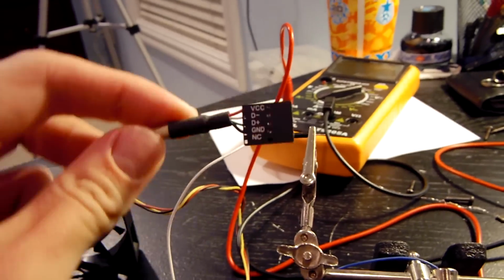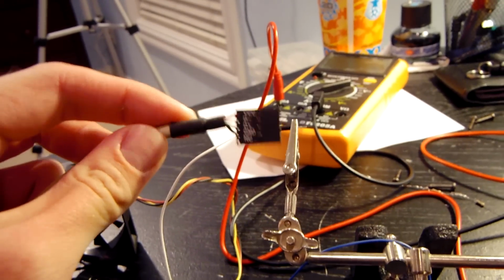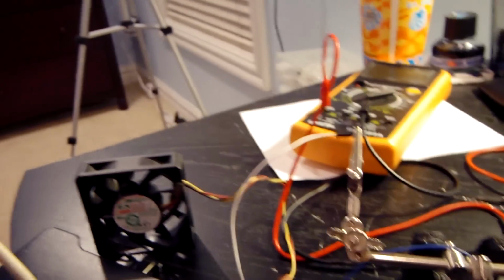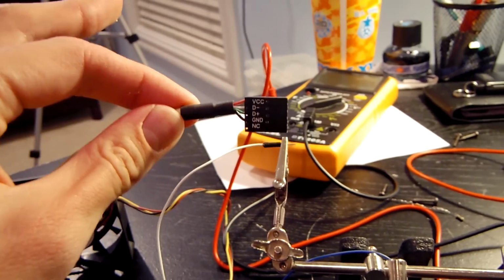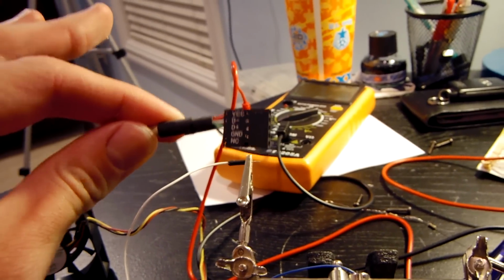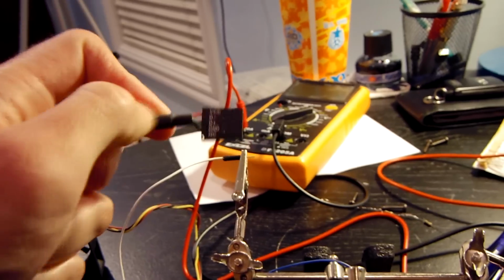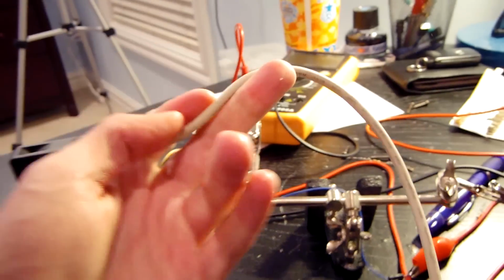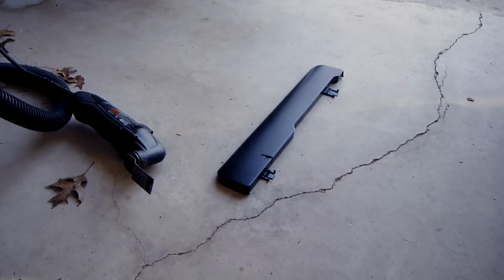But for this USB cable, you can see that the end has this little connector to it, which we're just going to cut off. This was actually meant to go into a socket on a motherboard, and was used to connect some kind of external drive. So I'm going to cut this off. Obviously, we don't need all those wires, just the one for the 5 volts from the USB, so we can cut off all the wires for data transfer. I'm probably going to need to make this longer as well.